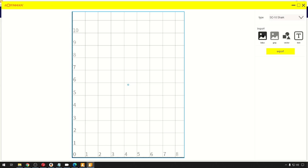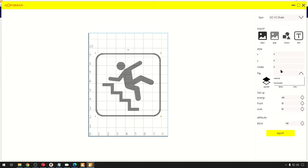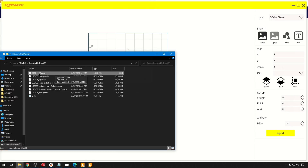We'll click on black and white and use the Chris's Basement logo for a test. Once you have something pulled in, you can drag it around, move it, make it larger or smaller, rotate it, flip it — just a few transform options. You also have setup features: the energy setting is the laser intensity, and the lower number is actually more intense than the higher number. I'm going to leave this at 300. You also have two work speeds in millimeters per minute — one appears to be travel speed and one is the actual engraving speed. The software needs a bit of polish, but it'll get us by. We'll export this to the SD card — laser G-code files will have an LGCO extension instead of the regular G-code extension.